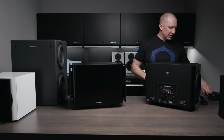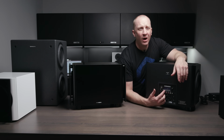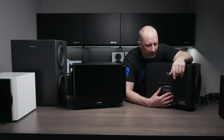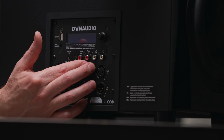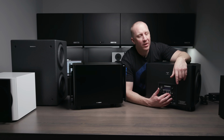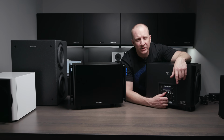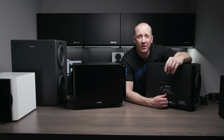This subwoofer, as well as the sub 6, has a DSP built in. So it has a tuned setup filter where the dB slope is set up, the octave slope is set up, the crossover is set up with the proper slope for each speaker. So LYD5s, LYD7s, LYD8s, LYD48s. I think it has the Core as well in there. So I can go in and adjust the crossover via the menu system to be tuned specifically where it's designed to work, very specific with the Dynaudio speakers.